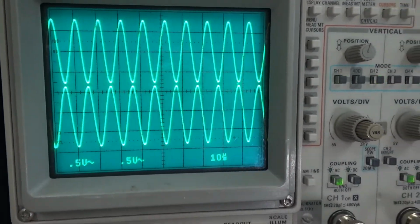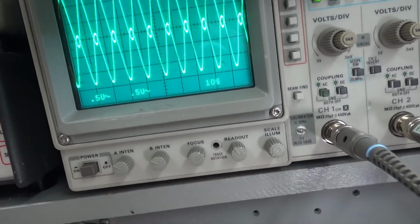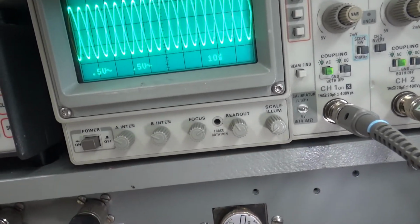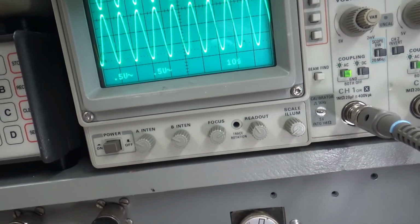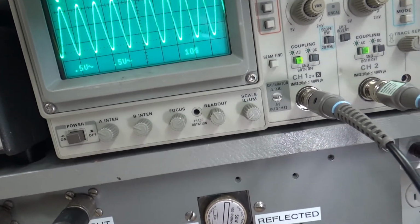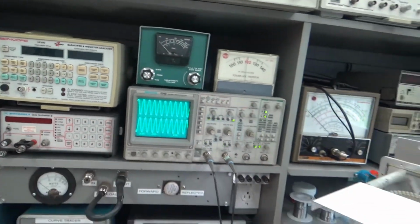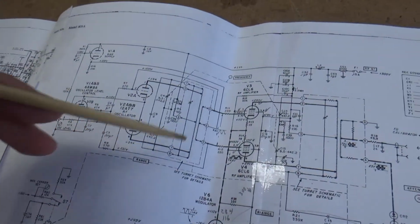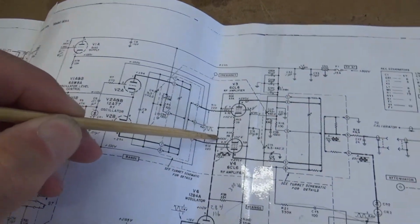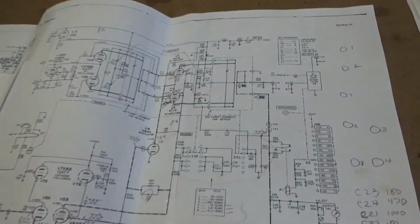As far as I can tell, the input isn't. You notice how that's out of phase with each other? Push-pull. Coming out of a tuned circuit is basically a transformer. Center tap transformer. So anyway, now that we have a reference, let's find out where it's fluctuating.